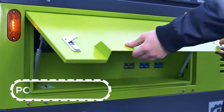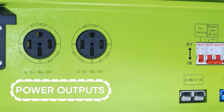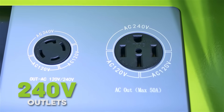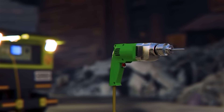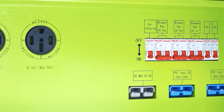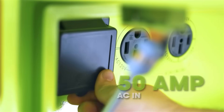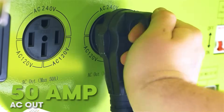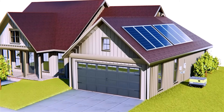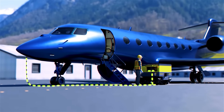On your Komodo, you'll find multiple power outputs for versatile energy distribution. On the front of the inverter are 120-volt and 240-volt AC outlets, ideal for appliances, tools, and industrial equipment. On the side panel, you'll find AC in and out ports to connect your 50-amp extension cables, allowing you to run power in and out of your home or facility. The NEMA output also allows you to power heavy-duty loads.